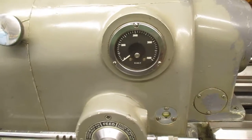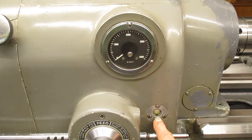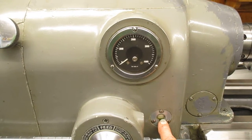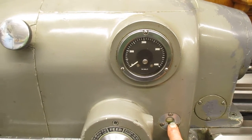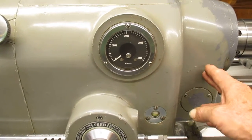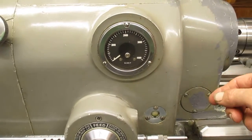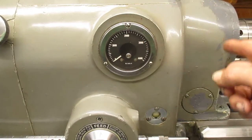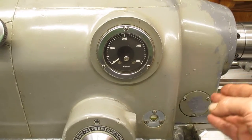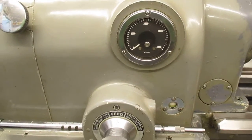This is what they did on later machines — and you'll notice that there's just one oil window. Sometime in the 60s, maybe the early 70s, I'm not exactly sure, is when they went with this. Notice there's no windows at the bearing locations. This headstock circulates the oil through the bearings. It's got a path of getting oil to the top, and it runs through the bearings and then out, instead of like the older machine with the bearing sitting in the oil.